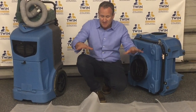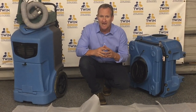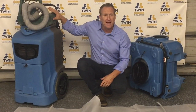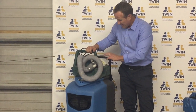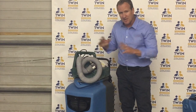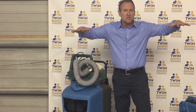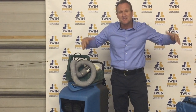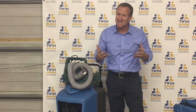Once this gets all built, after about three days of dry time, we come back in and utilize our fogger and sanitization. What that does is inject all of this mist inside the ceiling chase to basically sanitize and prevent any type of mold. It's a great way to get into all those nooks and crannies that you can't reach through that small hole when you dry down.